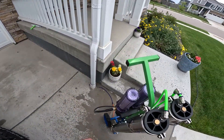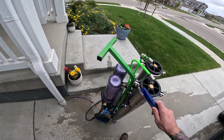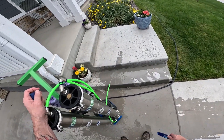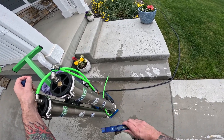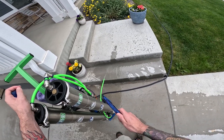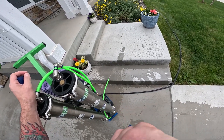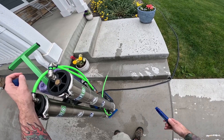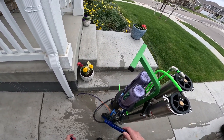You don't need to go through your DI. Pre-filters are never going to really remove any total dissolvable solids — it's always going to be your RO and your DI. The other thing that can happen with ROs is that you could get a high PPM. But if you're finding that no matter what — if you attach a pump, no matter what the pressure or the source — you're not getting any water output, that means your ROs are most likely clogged and fouled. ROs really work best at above about 45 PSI. From there you'll get okay to good to really great flow. If you're lower than that, that is typically the biggest reason why a system won't put out much water.